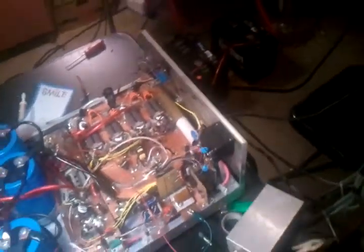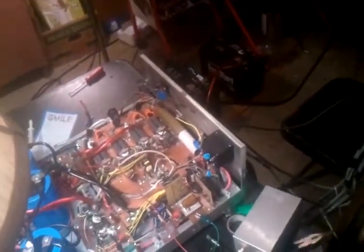I came to the issue of the fellow wanting a variable or some sort of high-low-medium switch, and, you know, how do I do this? Do I send the RF through 15 foot of wire to this remote head, then 15 feet of wire back to the box? I don't think so. I hadn't had a lot of time to play around with that. I'm sure if you use some good dual shielded coax, you probably could get away with doing that. But instead, I designed a little circuit using 2 SPST relays shown here. That equips a 47 ohm and a 75 ohm 5-watt resistor. And the resistor here is a 20 ohm 10-watt power resistor, which is in line at all times.